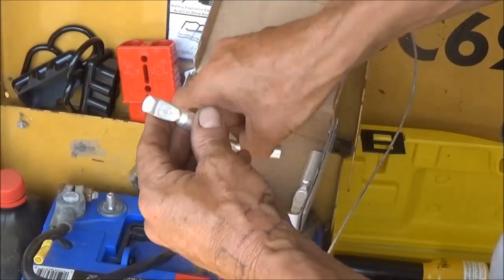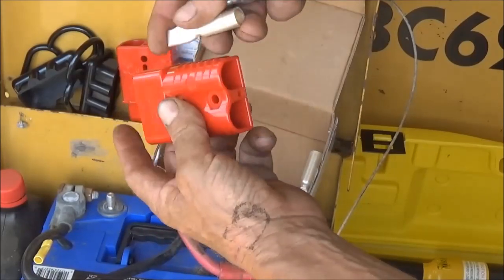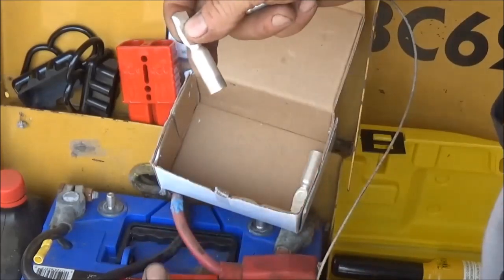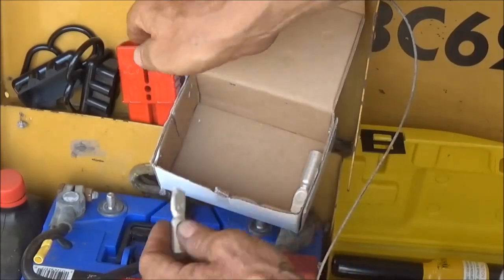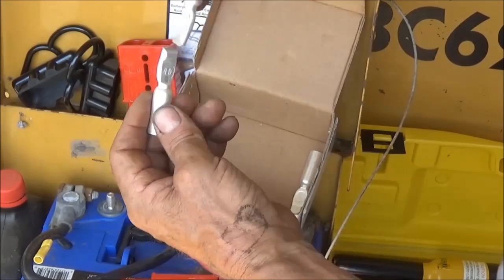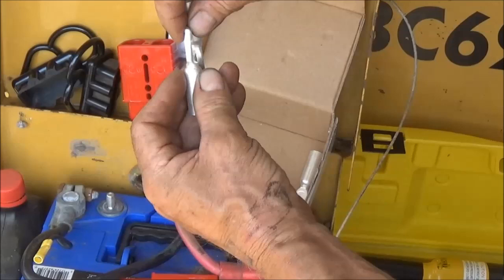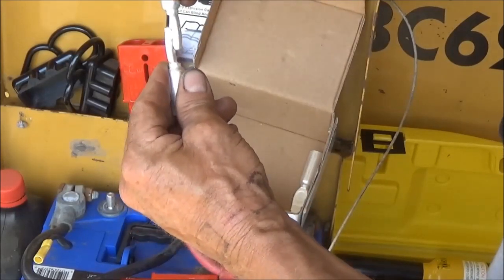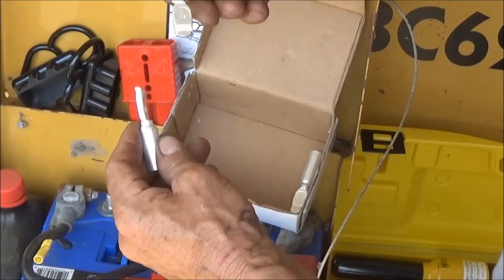So what I've got to do is take these two pins, get a cable clamped on them, and then they get snapped in there and locked into place. And when you plug those two red plugs together, these have a rounded side on this side, and they're kind of spring loaded on the back side with that piece I was flicking with my fingernail. It's going to be pushing these out. They're going to plug together tight like this, and they unplug that way. Got two of those and each one doing that.